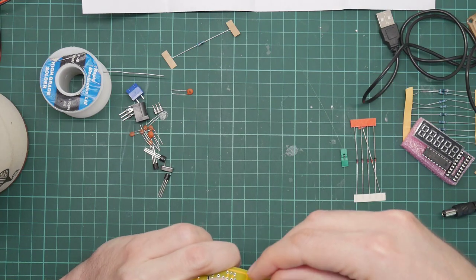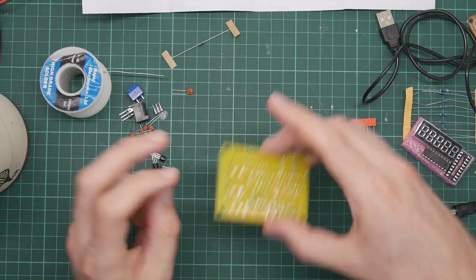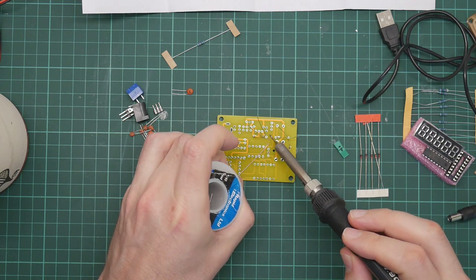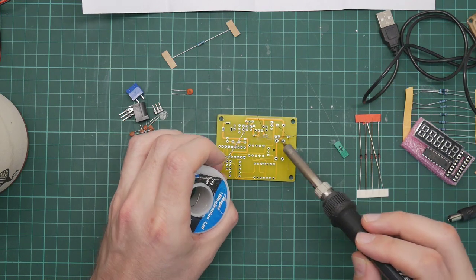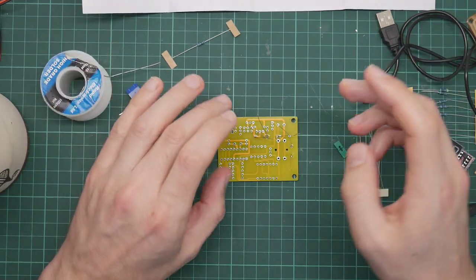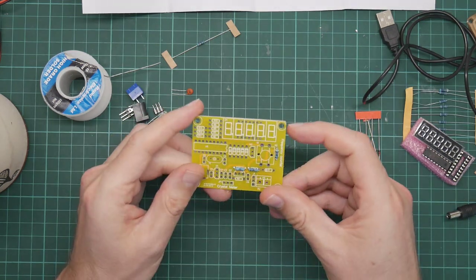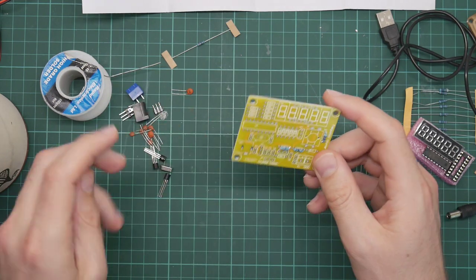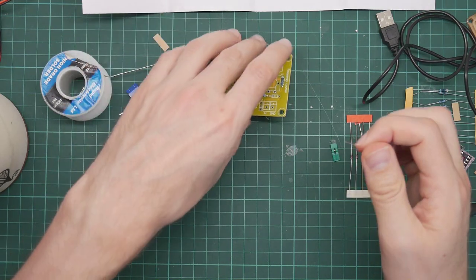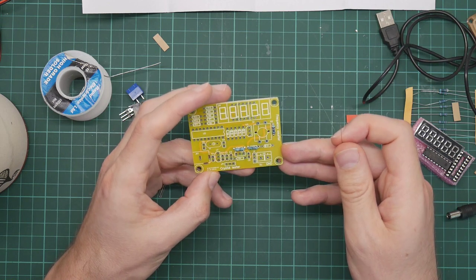So, the PIC instruction set is extremely peculiar. It's got a handful of bytes of memory mapped to registers, so it doesn't really distinguish between I/O devices and RAM. Depending on which version of the PIC you're using, the instruction set varies from 11 bits, maybe 12 bits up. So the program held in Flash uses a weird width of flash memory. I think it's 14 actually. So trying to actually copy programs into RAM, which is 8 bits wide, is very peculiar.